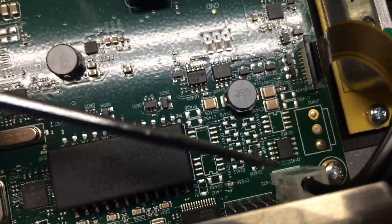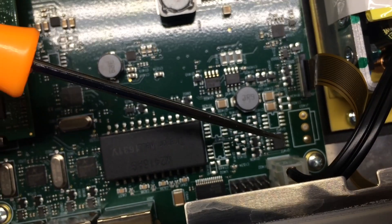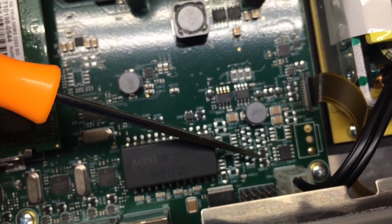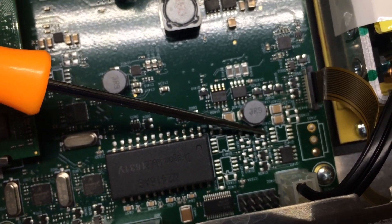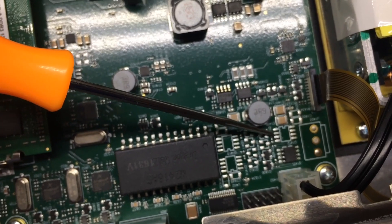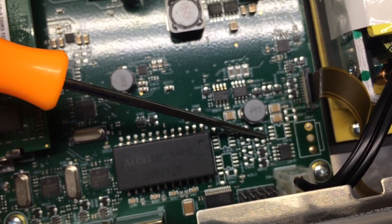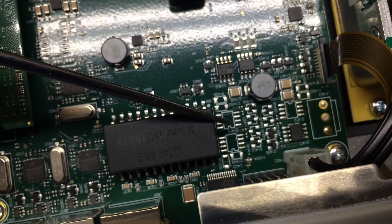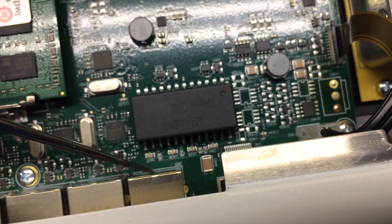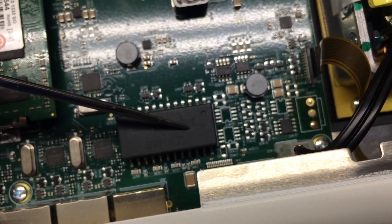It's only got a single power supply, which I don't understand. The main power supply goes into the connector that MikroTik provides, through a little diode switch — a general purpose transistor and general purpose diode. If you look, they've got the spot on the board here to populate another one: a diode pack, a 68K resistor here, another 68K resistor here, a duplicated header on this side, and this jack is also meant to be or can be PoE.